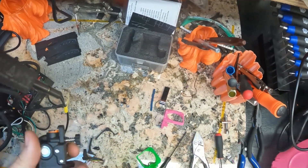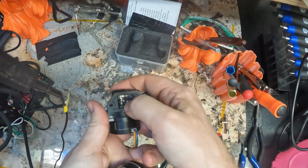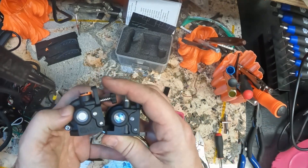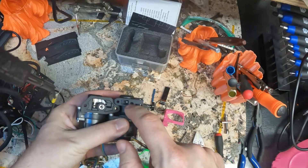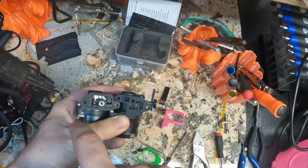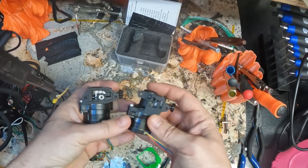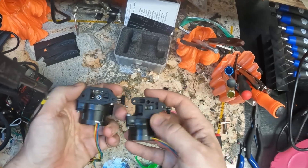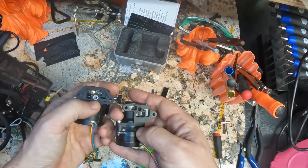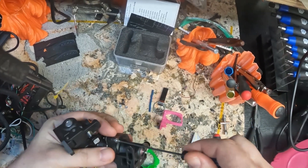You notice the integrated Bowden coupler - that's pretty nice. There's a metal filament guide right down there. The drive gears look the same size, but the big thing is the drive gears are rotated around facing backwards, so the filament path is a lot closer to the motor and to the center of the system. They also adjusted the screw holes - on the 2.0 they're in a line, on the 1.5 they're offset. The distance between the holes is the same, though.